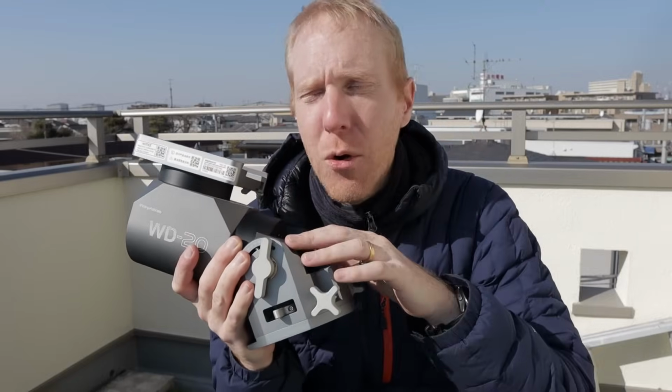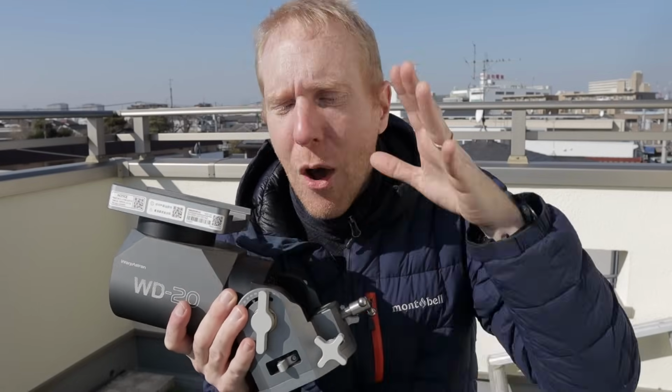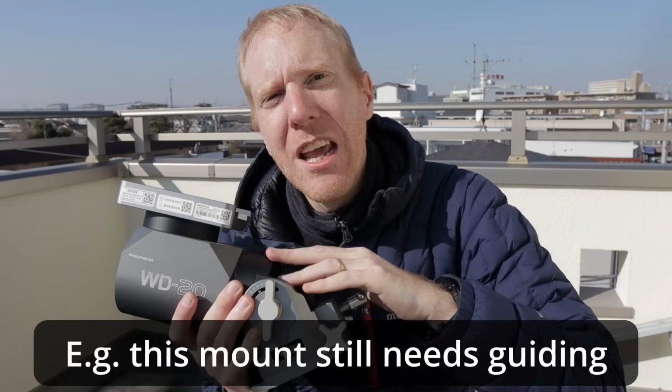When you see encoders in the description of this mount, and I'll have all of the links, of course, down in the description, we mean encoders that let the servo motors work as expected. I don't mean things like Renishaw high-quality encoders like you would see in Astro-Physics mounts, in 10 Micron mounts, or in the iOptron EC series of mounts. Those are absolute encoders, and they're not quite the same as what's in there.